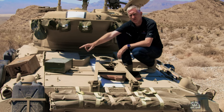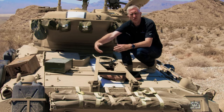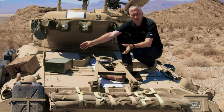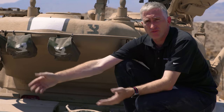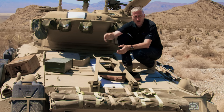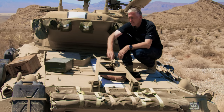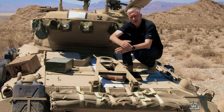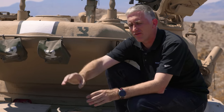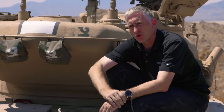Other items on the engine deck: on the far corner you're going to see the other latching point for the tow cable. You'll only see M50s in ready service with one tow cable per vehicle, which may seem odd because usually these days we're used to two. But it's not really necessary, because if you're recovering a tank with another tank by tow cable, you already have two tanks there and each one has one tow cable — so you have two tow cables available. The gun travel lock is located here — a big one they had to move because of the length of the gun, as the original travel lock on the Sherman was on the front. The exhaust was relocated in the 1970s from the earlier position down below to up here. The Israelis love welding numbers and lettering onto things just in case the paint scrapes off, so on a lot of the fuel ports you see Hebrew lettering — it just says what is underneath to keep it simple for the fuelers, making sure you don't put the wrong fluid into the wrong hatch.